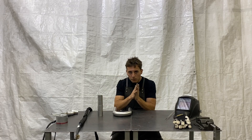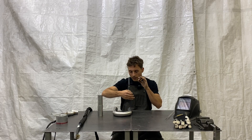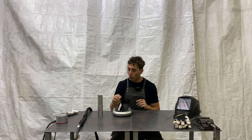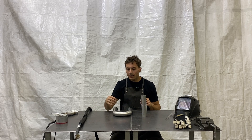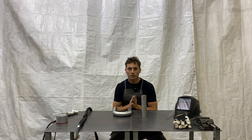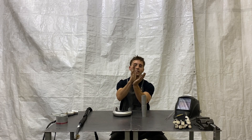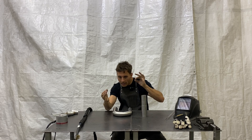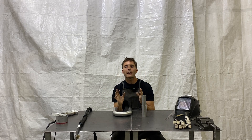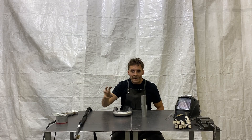We want to go max pedal at a target amp, and you're going to wait for it to get to puddle size, and then you're going to start ripping. For a lap joint, I found 40 amps works really good on just a straight joint. And once we get into the radius one, you might have to lift a little on the pedal — that kind of 37, 38, 40 amperage range. What this is doing, and why we do this, is we want to eliminate an important variable. You don't want to be welding some thin, beautiful material at a hundred amps and be floating the pedal in the center as you're trying to navigate around the tube.